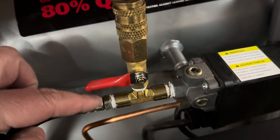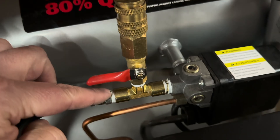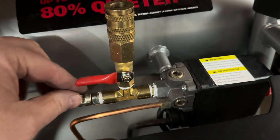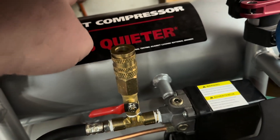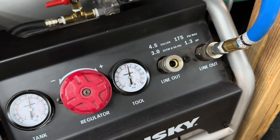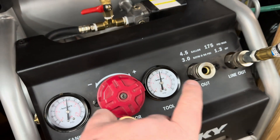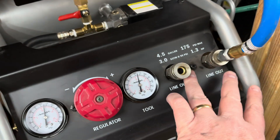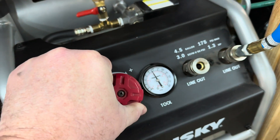So I decided I was going to get a T, and I thought I'd connect a T to give myself an outlet. Basically what I wanted to do was have a way to expand my tank, so I can take this and go to another tank. I used to do this a little bit just by using this second line on the front, but that's behind the regulator, and I want this secondary tank to get to full pressure, and then I can just make use of these two lines and regulate that air however I want.